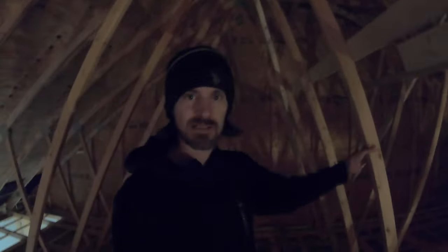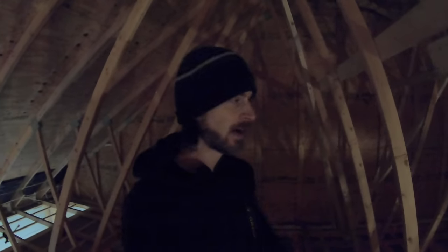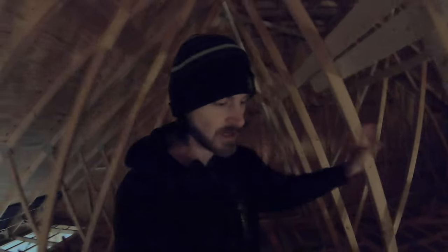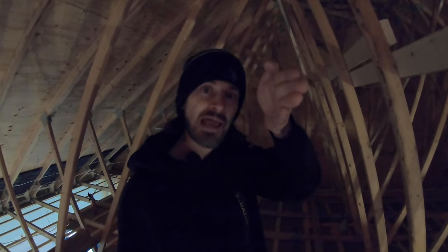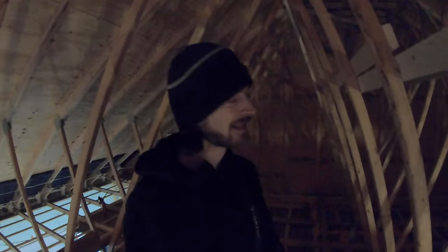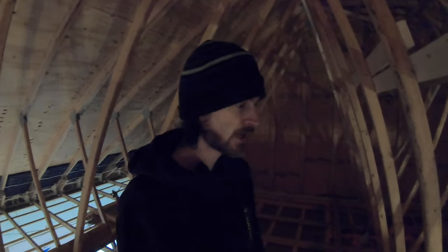You might even see, if my drywall gaps were a little big, some of the foam might actually drop down onto the floor, but that'll be fine. We'll cut back on the spray foam when we take the half inch drywall and put it up there to meet the ceiling. We'll just cut back the foam a little bit, and a lot of these spots I'm hoping the mud will take care of.